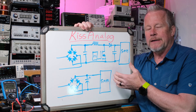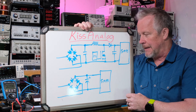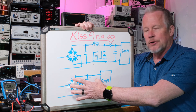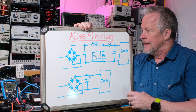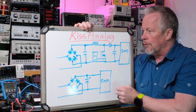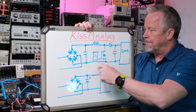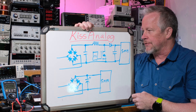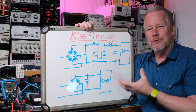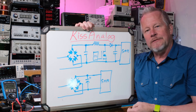If they put a linear regulator after it — which I'm going to do one of those eventually too, as part of this project — then it'll be a true linear power supply. Otherwise, just a low-frequency switcher. So do we want a low-frequency switcher powering our switching power supply, or do we want to add this stage? This is power factor correction — active power factor correction — because you actually can do it passively, but it just doesn't work as well; it's big. So it's a lot easier to do active power factor correction.